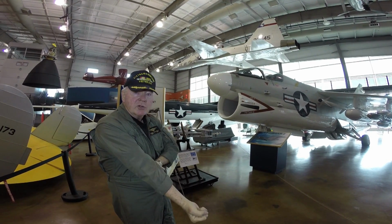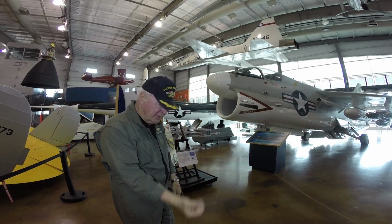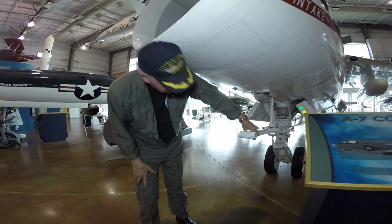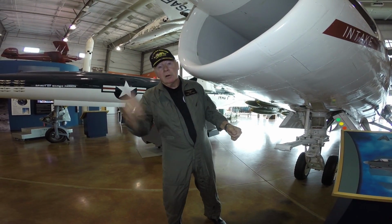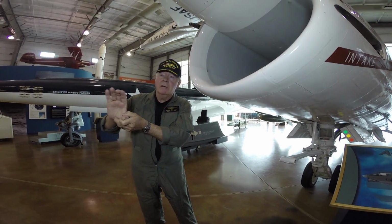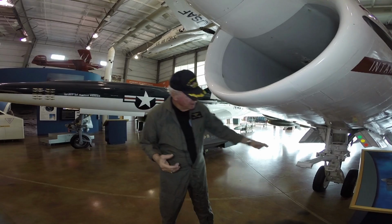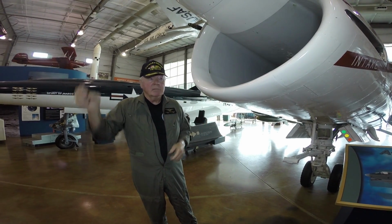Stop. Put your launch bar down. That's when you hit that button over there. It's on the left. Comes down. And then he's come up the catapult too. He's at the back end of the catapult, where the shuttle will hurl you into the air, essentially. So this comes down, and then behind that there's like a hook standing up, and it hooks down there. It's all connected with the catapult apparatus. They'll tell him to take tension, and they'll tighten it up, and now you're ready to go flying. Catapult officer will be over here.